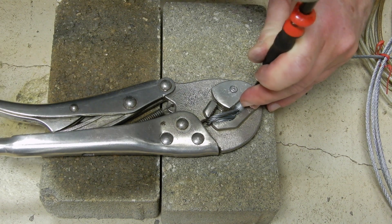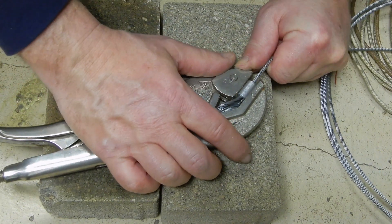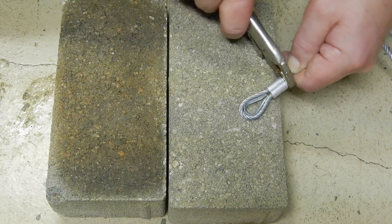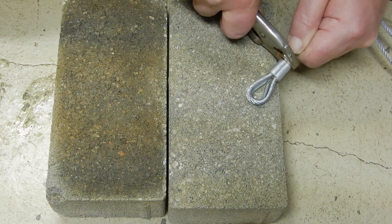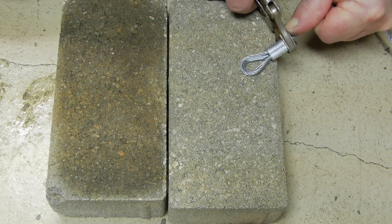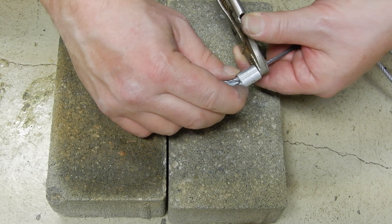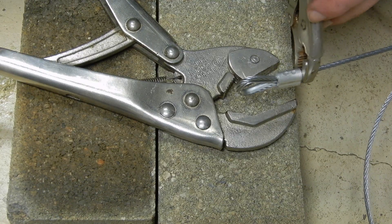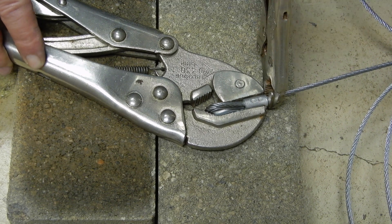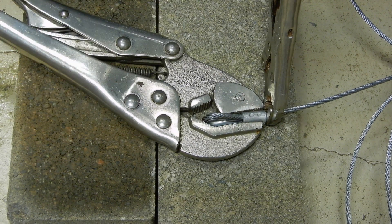I begin to put the two. What you want to do is, when you have pre-punched as I've done, you take a small vise grip and block the ferrule just by pushing it so that you have a nice loop. You can see the nice loop, which is well clamped. Now that it's well clamped with the small vise grip, you put it back with the big one, which is just going to hold it in position so that you can hammer-punch the ferrule.